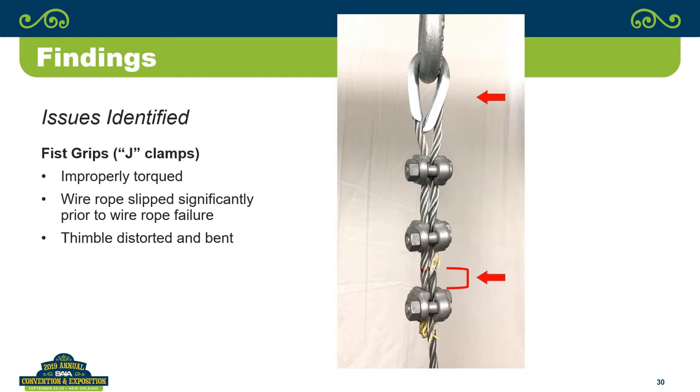They don't strip the way they used to. In the old days, when they were forged completely, you'd strip it and then you over torqued it. But now with the pressed in fastener, you've got a regular fastener in there that'll take a lot more torque. So you can over tighten them really easily with a gun that's going to put out 60 foot pounds, which is what most of the small impacts do. Now imagine over torquing, you're going to start breaking the strands too, so you weaken it significantly.